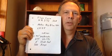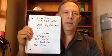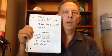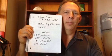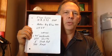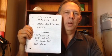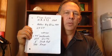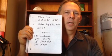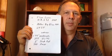The wire speed we're going to be welding with is set on the wire feeder at 195 inches per minute. On the welding machine, we're going to set the voltage at 23 and a half volts. We'll be welding in electrode negative, which is the opposite of stick welding, which is electrode positive.